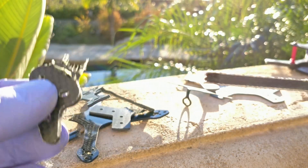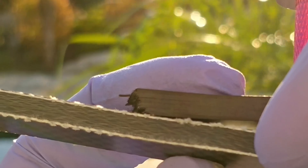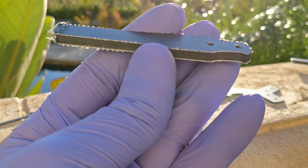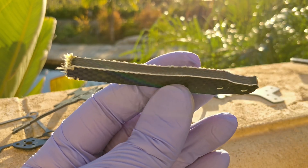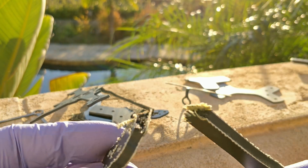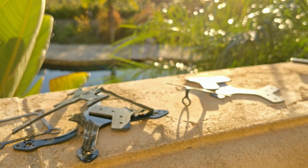Last but not least - if you look at the side of this arm compared to this other arm, the bottom arm has kind of waves in it whereas the top arm is all flat with straight lines. Those waves indicate that the entire arm is made of woven top-layer sheet - the whole arm is made of fabric and the manufacturing is totally different. They also added woven sheets of Kevlar on top. This kind of carbon is way harder to cut, but look at the way it breaks - it doesn't break the same way. It breaks more like ceramic because it's so strong and much harder to break in general. Don't forget to floss - I hope this was helpful for all you guys who make your own frames.